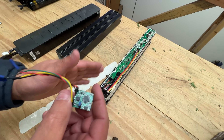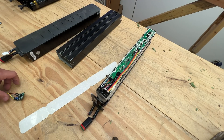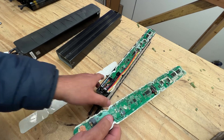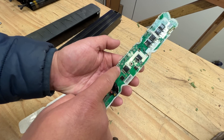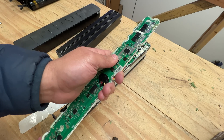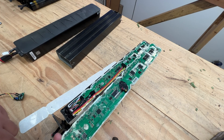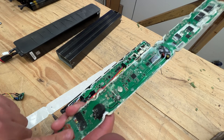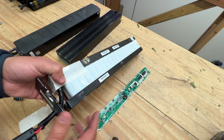There's also a third way to use it. Some people posted after we sold a bunch of these that there is another hack where you put one of the pins of this chip to ground using a 1K resistor, and that would also wake up the battery. It would do the same thing — it would turn on that switch, basically, the same way that the CAN commands do. I'll link that video also in the description. That's how you can use these batteries.